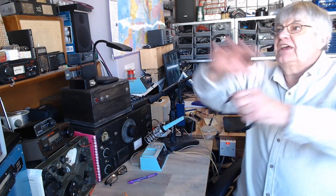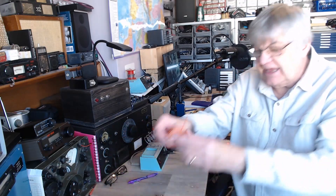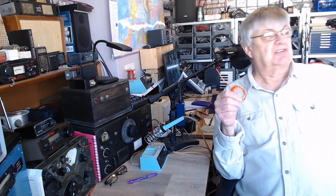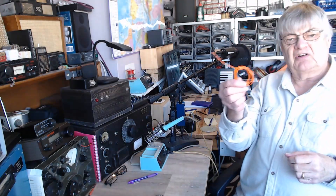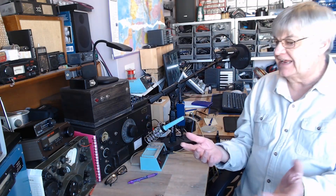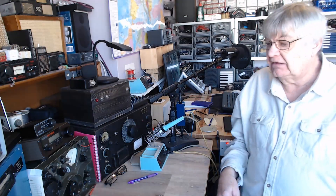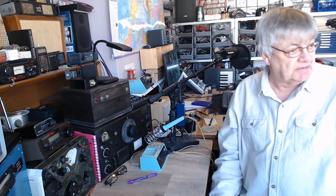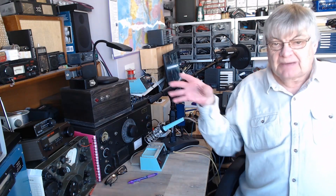It's worth doing, especially in a receiving area like this. I use my hundred-foot end-fed to transmit on occasionally — it's a bit of a backup aerial, mainly for receiving. Bringing the coax in means I'm not radiating in here — I'm not bringing the aerial wire into this room. Because if I did, I'd have RF everywhere: I'm sticking 100 watts of RF up this wire and it'd be all in the room. There's also a fluorescent light fitting up there that can cause interference.